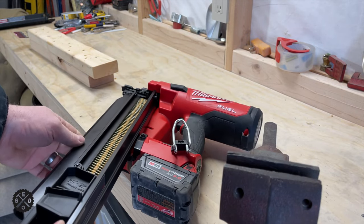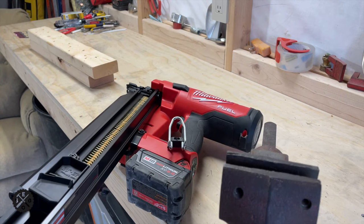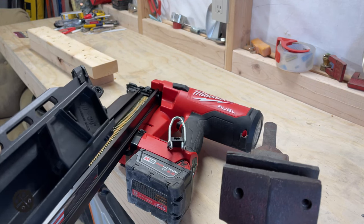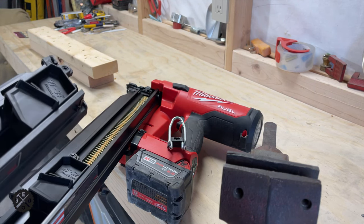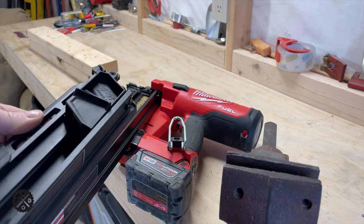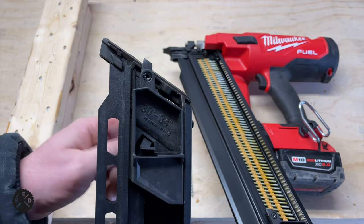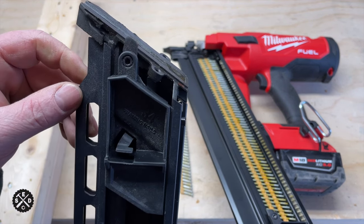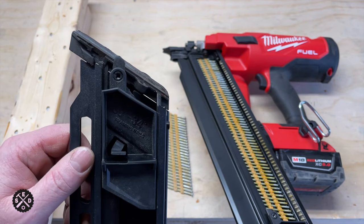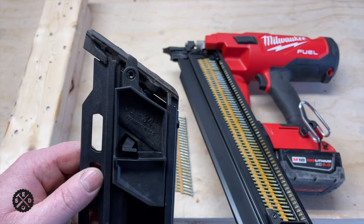So as you can see, it does work to convert your 30 degree to a 21 degree. People have wondered about warranty if you do something like this — well, why not just hang on to your 30 degree magazine? You're going to want it anyway in case you want to use 30 degree nails, which is the purpose I'm using it for. And then if you need warranty work done, just put this clip back on — it's only three bolts. Another question: what if you have a 21 degree nailer and you're converting it to a 30 degree? I think you could just grind on the opposite side because it shifts the opposite way. I think the same idea works — you just have to offset this notch a little bit differently.